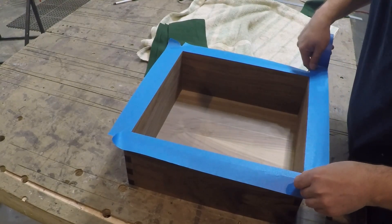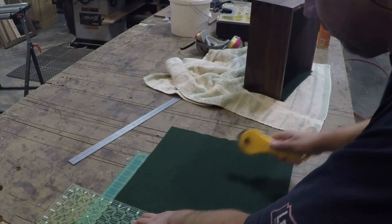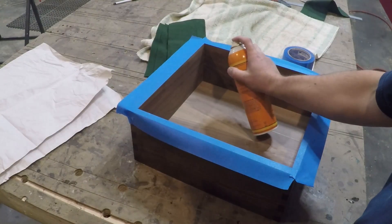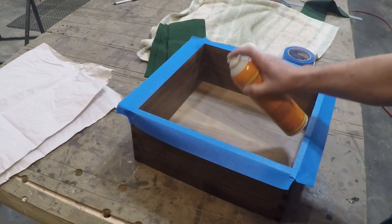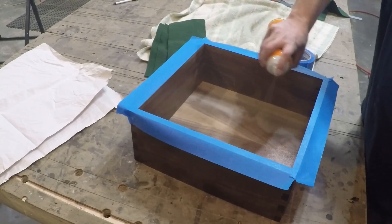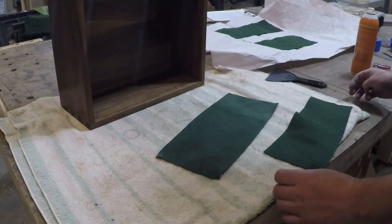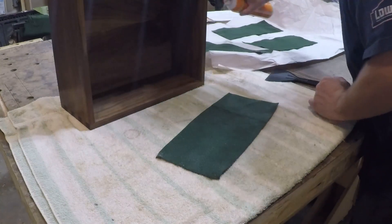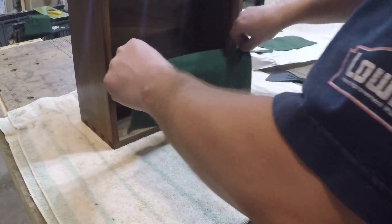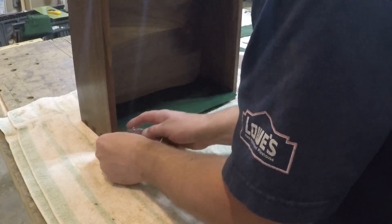I'm taping off the box so it won't get any spray adhesive on the edges. Next was to cut all the pieces of felt to line the box. One of the most common questions I get is what type of glue do I use — whether it's epoxy, wood glue, or spray adhesive. For epoxy I use West Systems brand, for standard PVA wood glues Titebond, and for spray adhesive I usually use 3M, but today they were out of 3M so I bought the heavy duty stuff. Unfortunately after using it, the edges of the felt peeled up and just didn't stick well — not anywhere near as strong as the 3M stuff — and I ended up having to tear it all out and redo it the next day.